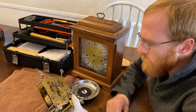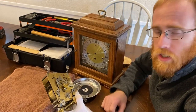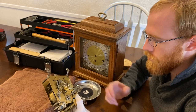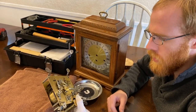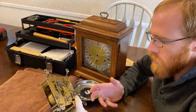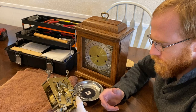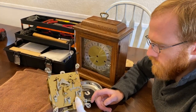So what happened? A customer brought this clock and said it had been overhauled a few years ago and charged a bunch of money for it, and now after four or five days the chimes and strikes stop working. So it's like it runs out of energy in the middle of the week. I got to looking at it and saw signs that this clock had been vatted.